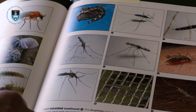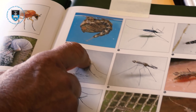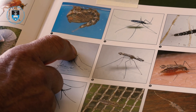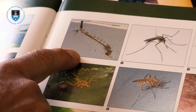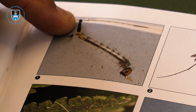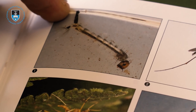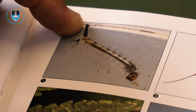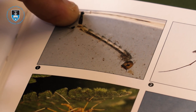The life cycle of the mosquito starts with an adult, which lays eggs usually near the water source — and of course this could be the inlet to your water storage tank. This develops into a larva. The vulnerable part of the larva is a little breathing tube which must break the surface tension of the water. If you have a layer of oil — in fact any oil — on the surface, this little siphon gets clogged up and the mosquito larva dies within a few hours.